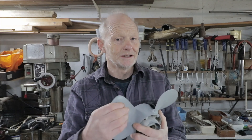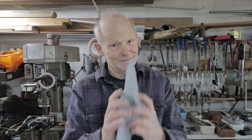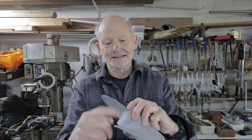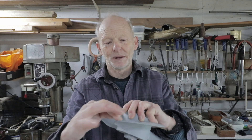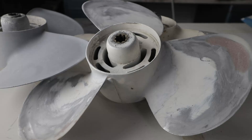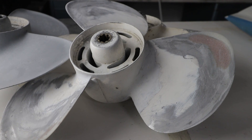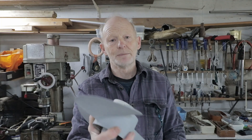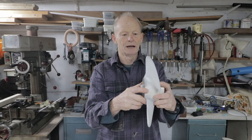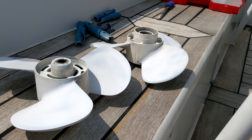When I modified the main propellers I went slightly more extreme than the practice propeller. The castings on the main props weren't as good — they started to crack and get damaged. On future versions I did less bending and filled with epoxy. We have to use Yamaha propellers as they're very specific to the 9.9 engine. On the latest voyage they worked really well in rough water, giving much more drive, though they are prone to a little damage because of the filler.